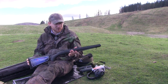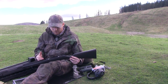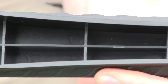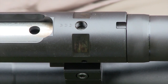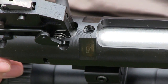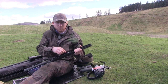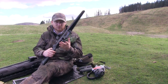In terms of bedding, what Ruger have done is try to eliminate the problems with placing a metal receiver and barrel into a synthetic stock — sometimes quite flimsy bedding. They've come up with a concept called power bedding. What they've got is two V-blocks: one at the front and one to the rear of where the magazine sits, just in front of the trigger. These V-blocks correspond to slots in the receiver itself, and the recesses that the power bedding sits inside. It's very similar in concept to your Tikka T3.